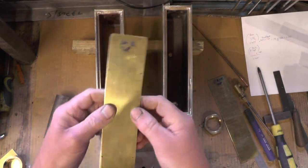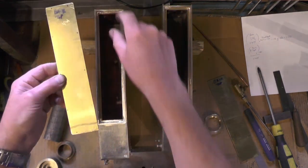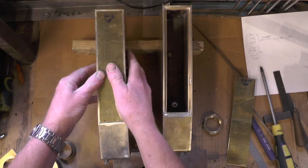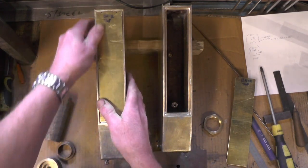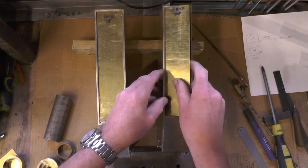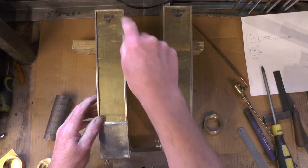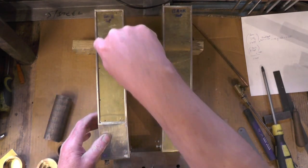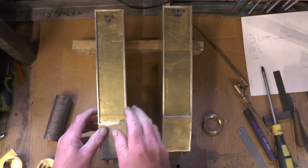I've just had a little bit of bench fitting work making these tops - a bit of hacksawing and a bit of accurate filing. I've got them to be a nice fit now on both tanks, maybe too good a fit really. It is a push-on fit on both of them. What I've got to do now is drill all the holes.